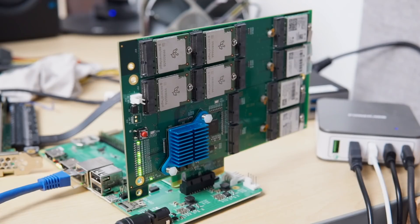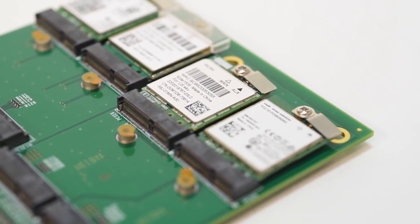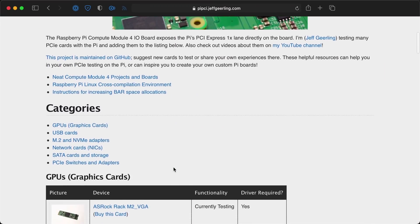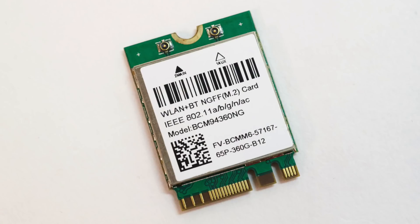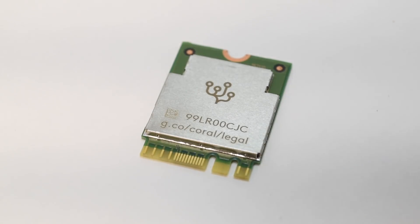What business does this thing have being plugged into a Raspberry Pi? Well, there are two things I've already been doing with it. First, I can test tons of different M.2 Wi-Fi cards, and even test them at the same time without plugging and unplugging them. I've already gotten the Intel AX200 card working, and if you follow my Pi PCI Express card database online, you can follow my progress getting other cards like the Killer 1535 and the Broadcom 94360 running. I can also plug in other M.2 devices like Google's Coral PCI Express TPU — did I mention Alftel sent me four of them to play around with? And there are a lot of other little devices that can be used too, like 4G or 5G modems.